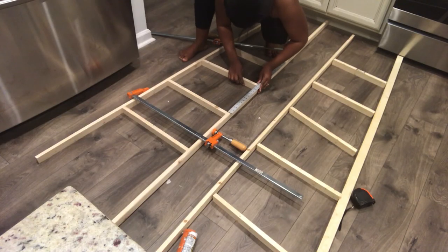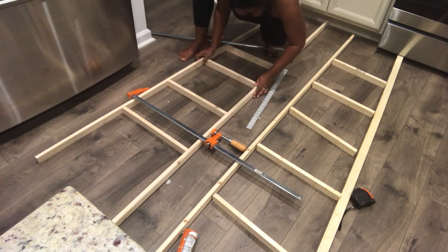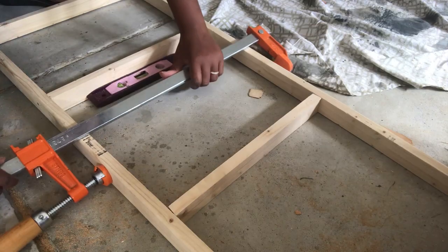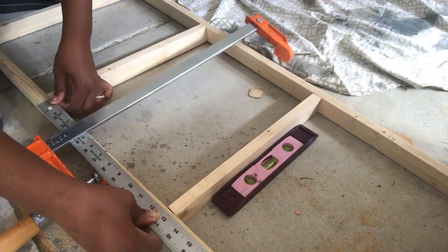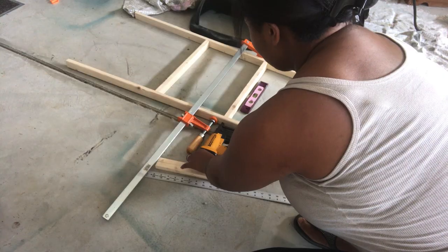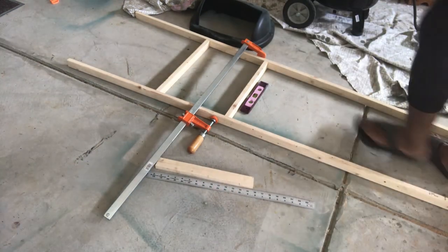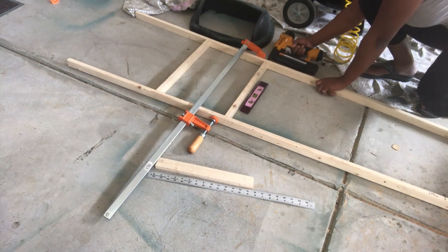After a practice run, I'm going to come back and use my clamps to clamp the wood together, making sure I'm getting these angles right so they're positioned correctly for when I nail them. In this next clip I'm using my leveler and clamps, putting the rails at the 12 inch increments and making sure everything is straight so we can come in with our nail gun and shoot them into place nice and sturdy. We're going to continue doing this up the ladder.